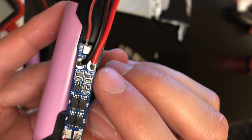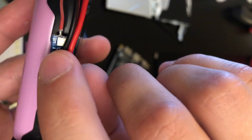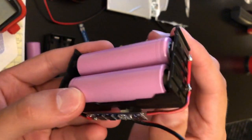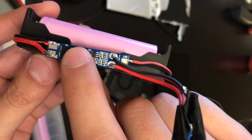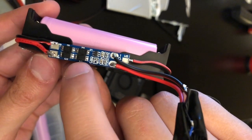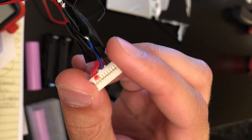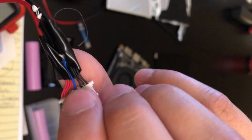Lastly, we've got the charging lead — positive and negative — for the input and output of the battery pack, which are soldered to P-plus and P-minus. When making these solder connections, first make sure the batteries are not installed. You do not want to put excess heat into the batteries as you risk damaging them or they could catch fire, so please be careful. When soldering on the PCB, take care not to damage components by leaving your soldering iron on too long or accidentally contacting one of them. This blue wire ties to the thermistor, which then ties to the ground wires.